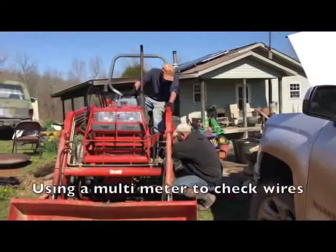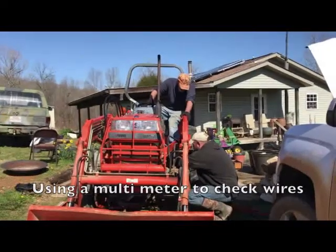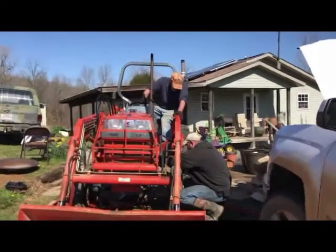We had a leaking piston is what we started out with. So we had to get that addressed. Going through all that, trying to fix it, the tractor stopped starting again. So, of course, I had to switch back from our front end loader to the tractor, trying to fix it. Figured out it was the battery, or actually it was a bad battery cable. So cable off. Here's the power, positive. And so when I would check it with the multimeter, it would read fine until you went to start it, and that wire hooked up and would short out.